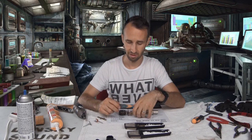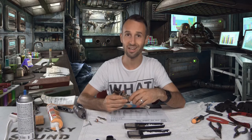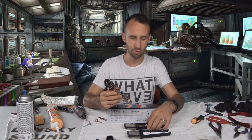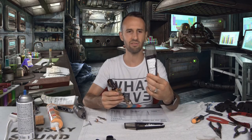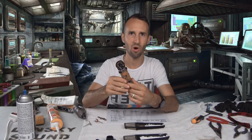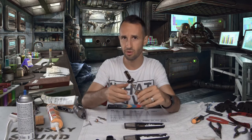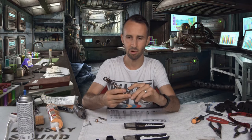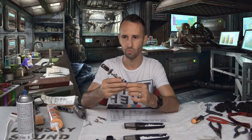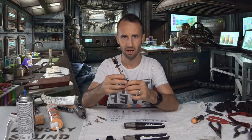Now this part is probably the most potentially treacherous aspect of what I've done here. So far we've only done stuff that's really kind of cosmetic and mechanical, but now we're actually getting close to the diaphragm itself. We don't want to slip with the screwdriver and put a hole through the diaphragm, because then the entire mic is basically wasted. Yeah, I could install another capsule, but that's not the purpose of this experiment. So let's take a look at removing the resonator discs from the front and back of this capsule here.